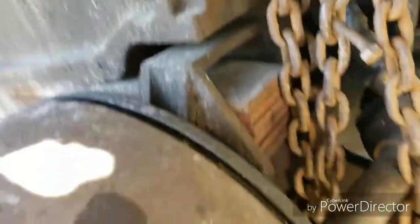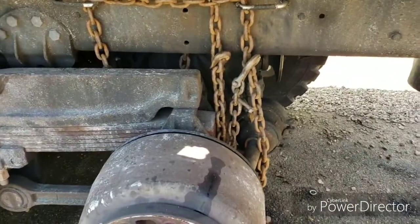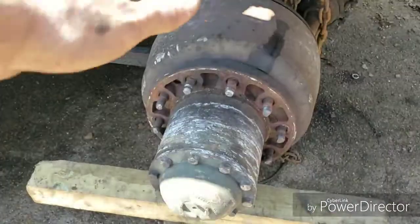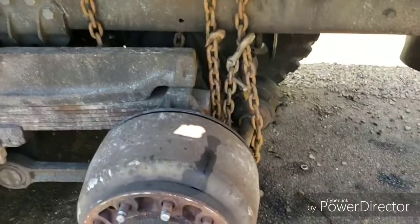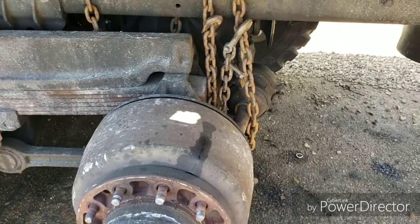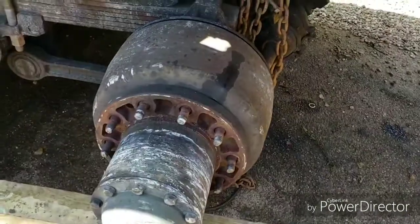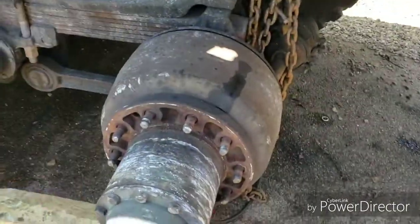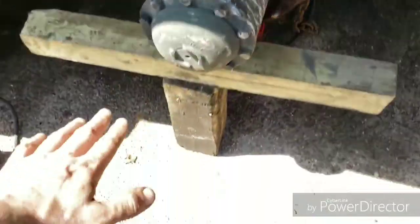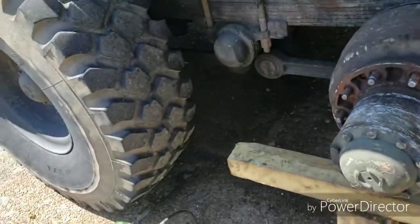With this double-chain setup, each 3/8 chain is rated for about 5,000 pounds, so you're in pretty good shape on weight rating with them doubled up. You want to get the drum as high as you can and then chain it up like that. I don't use binders if you have a load behind you. If you don't have a load, use a binder all day long — just chain it up once with a binder and call it good. When loaded, get it as high as you can, run two chains, and let it go. That drum may drop down maybe a few inches below your other drum.